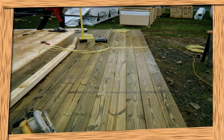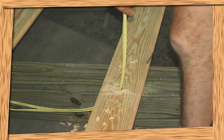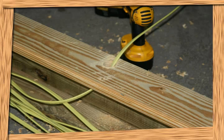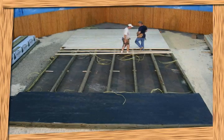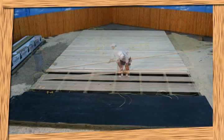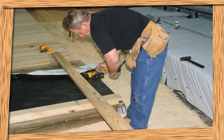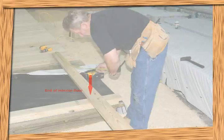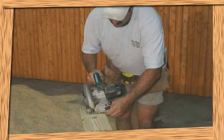When you get to a point where electrical wire is to come up through the floor, mark the position on the T&G boards and drill a one-inch hole. Pull the wire through the board and then fasten it into place. Continue to fasten down the T&G decking until you are less than one board width before you reach your final measurement for the interior floor. Fit but do not fasten the last board in place and measure to the correct interior floor measurement. Make a line using a long straight edge or a chalk line, then rip the floor board and fasten into place.